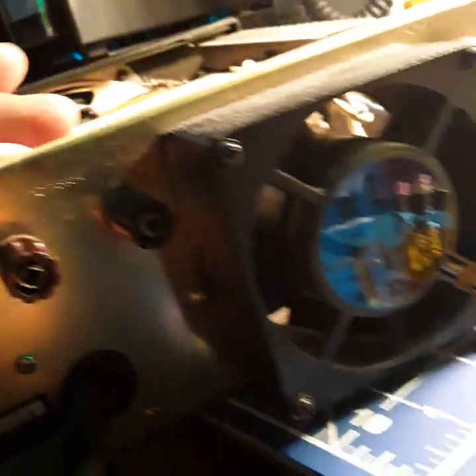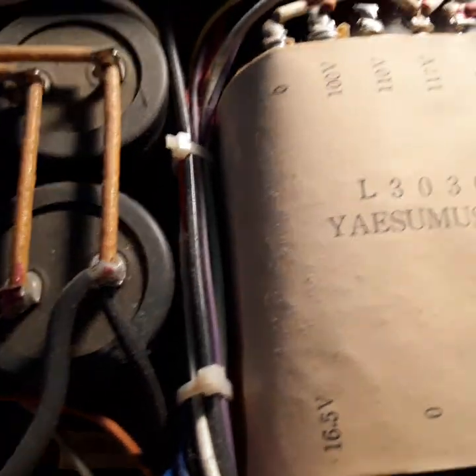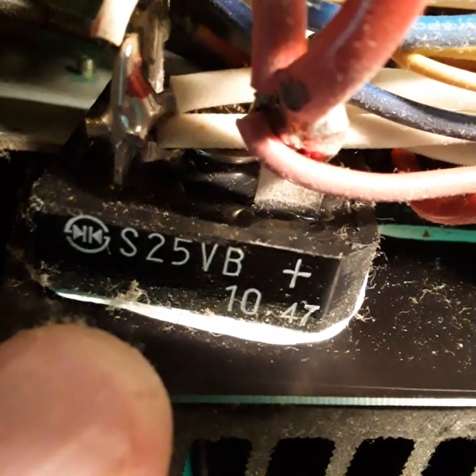On the back side it's got the fan option accessory. I might just hook it directly to put higher voltage into this one — I think it's already been done. There's a fuse inside I didn't even know about. Let me chicken-stick these capacitors — I don't feel like getting cooked just in case they're charged. Nothing. Inside is a little dirty. Here's the back side — this is the bridge rectifier, and I have a 25-amp one here.